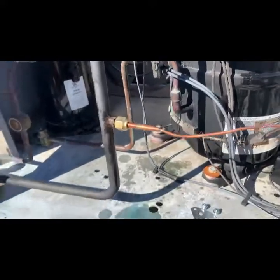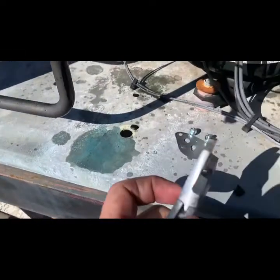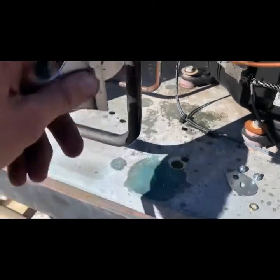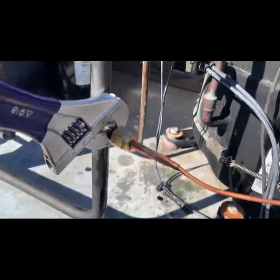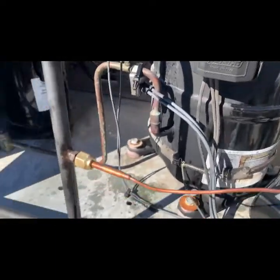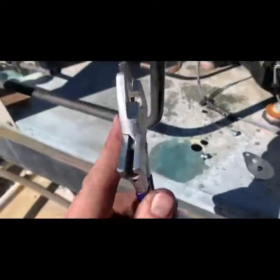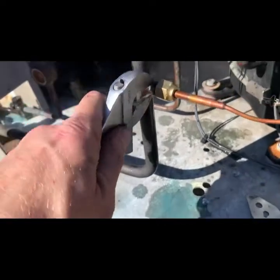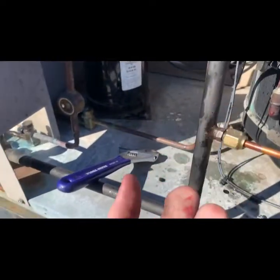Welcome back — just my two cents on something. I love this tool because it's skinny — it lets me get right in there with an adjustable to give backup so that when I tighten this I'm not twisting that off. My full-size 3/8ths wouldn't fit due to its width, but this little Klein wrench — you can see it's a half-inch — lets you bite in to narrow places. Put a drop of nylog on everything, put the backup wrench on it, torqued it down.